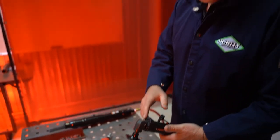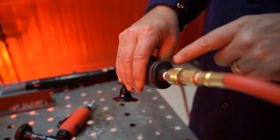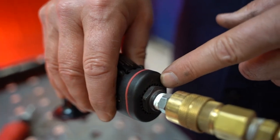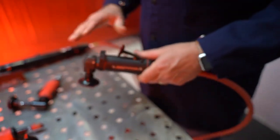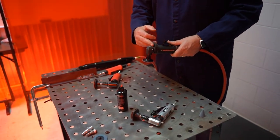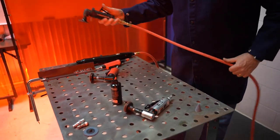This tool is set up to give you either front exhaust or rear exhaust, and it really depends on how you orientate this little red washer. Very few tools have the option of offering both front and rear exhaust. This particular tool is set up to exhaust air out of the back end, which is great for confined areas where air might blow at the work and springboard back to hit the operator in the face. If you have a wide open area, you can change it so the exhaust comes out the front — a good way to blow debris off, as long as it's not in the way of other operators.